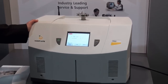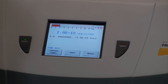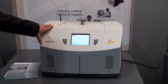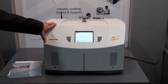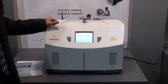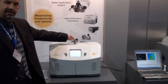The PRO2 is manufactured by the vacuum division of Varian. It consists of a high vacuum pump that's pumping on a mass spectrometer device inside the leak detector. Throughout the vacuum industry, when one has a system and they're trying to find a leak, the typical tracer gas used is helium for a lot of reasons. It's a very small molecule and can be detected in very small amounts. The end user would hook up their vacuum system to this test port.